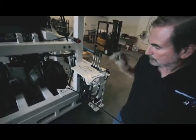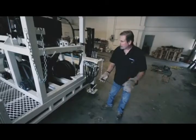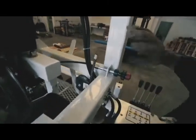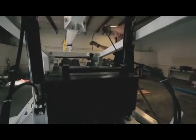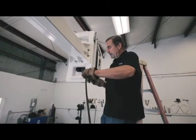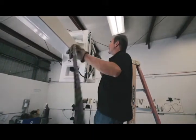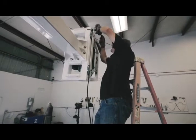Pull out about 50 or 60 feet of cable. Feed your sandline cable in through the first sheave, in between the two hydraulic rams. Route the cable underneath the lower of the two sheaves, up through the top, and back out again.